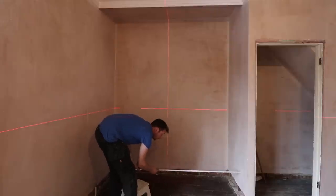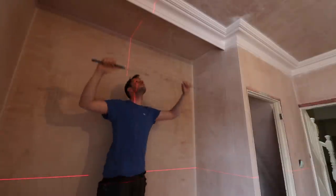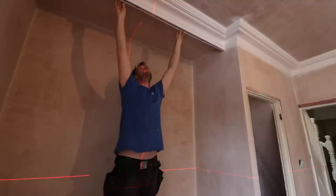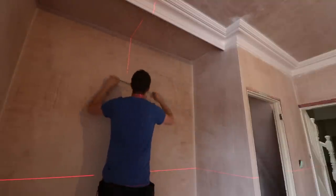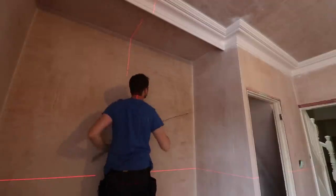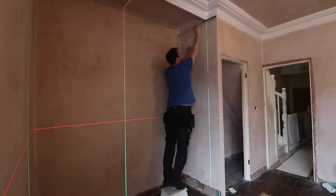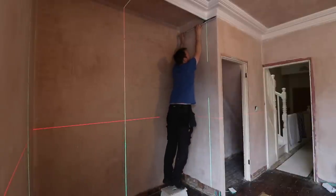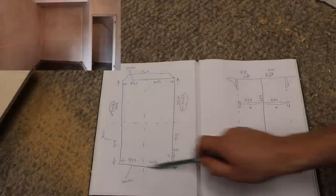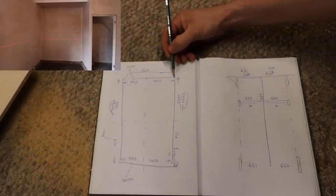I tend to write every measurement down from the four corners, and if there's any dramatic bow or weird wobble in the plasterwork I make a note of that as well, especially if it's deeper than the position at the corners. We can check the floor runs true from the laser line by measuring down to the floor in the position of the face frame, and also check that the ceiling is running true and level. If it's not, we put that into our drawing and work out where it's going to look best in terms of installing or what size to make the face frame. Once I've done the face frame position, it's time to check that the alcove sits square to where we're installing the face frame.